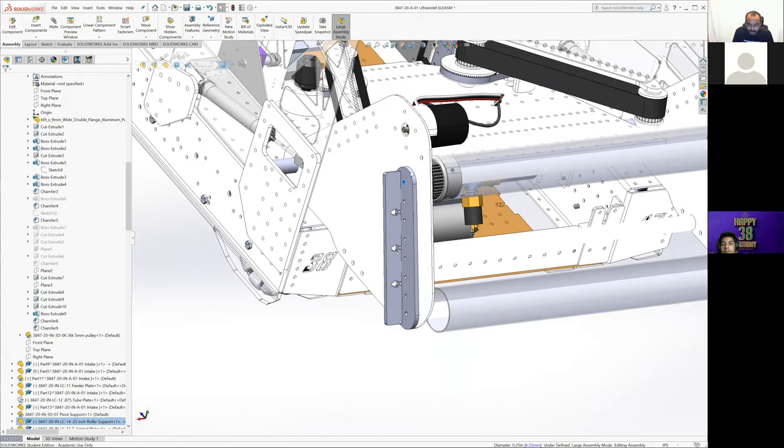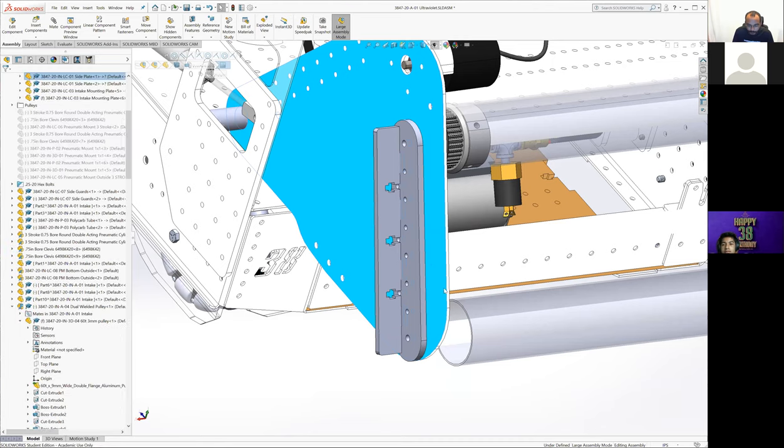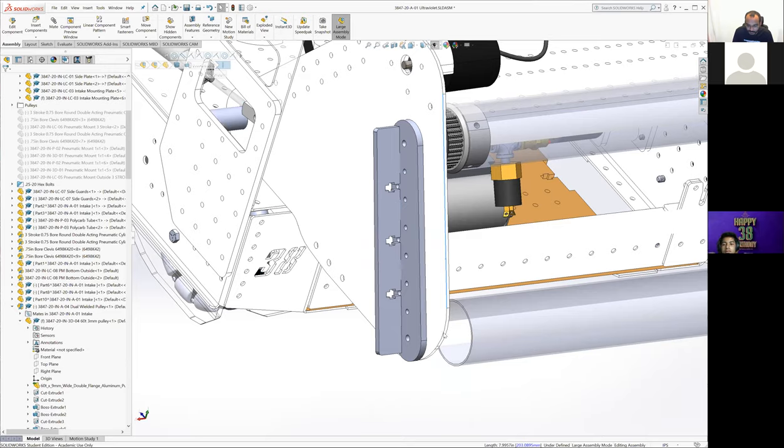There's definitely some other ways we could have stiffened this up if we wanted to, right? If we were going to fully remake these plates, we could have added some flanges. We could have bent this sheet metal to make it harder to collapse there, right? Just a flange across this face, this bend, possibly changing where the radius is and stuff, would have made that sheet more rigid immediately in that direction.